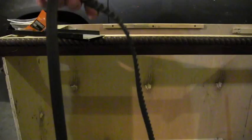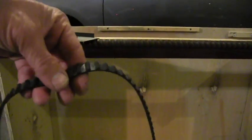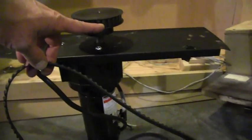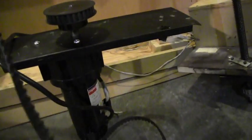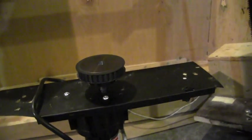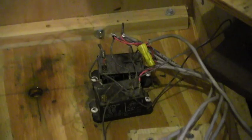This is the belt I used, and will use again — I see nothing wrong with it. It's a tooth belt that matches up with the gears on the drive motor and the sprockets at the bottom of the rods. That's a tremendous help, as you have positive pull and positive force as opposed to just relying upon friction.